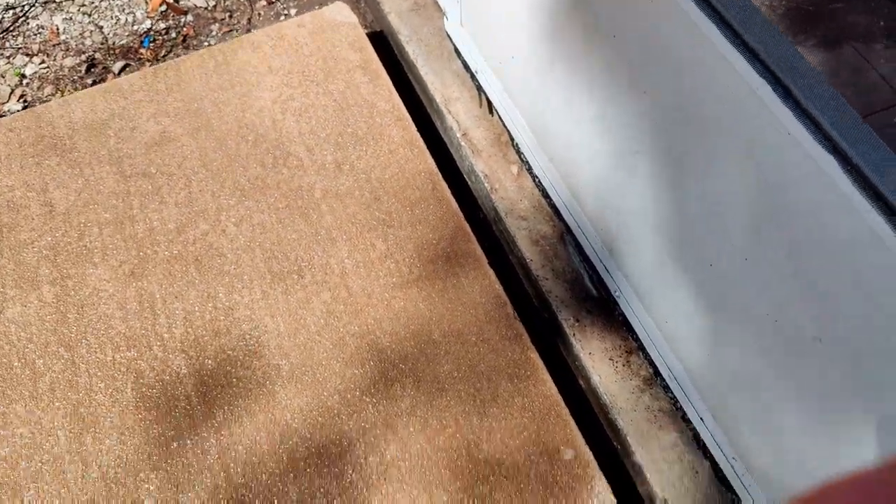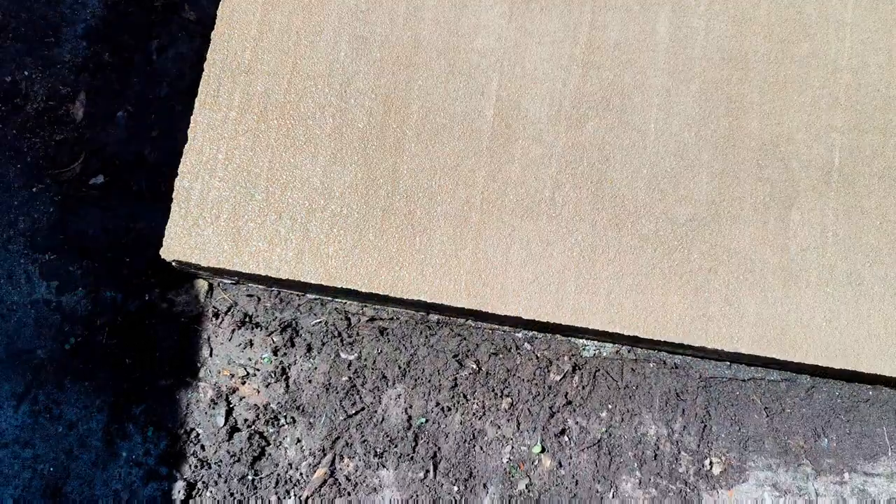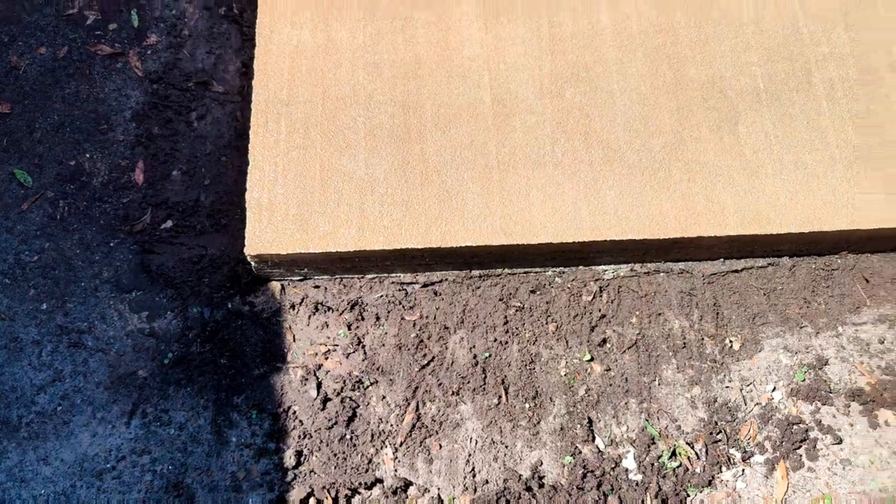Right here is where it was so tight. When I peeled off the two-by-four, it peeled off a piece of the slab, and I was like, my slabs are weak. In reality, what was going on — I figured out later — it was so wedged in that I had to pry it out of there. So when I pried it out, it peeled off those pieces. Back to the compressive and tensile strength: it wasn't that my slab was super weak, I just had it too wedged in there and it ended up becoming a problem.